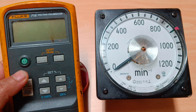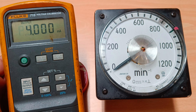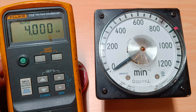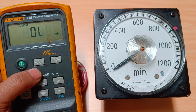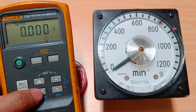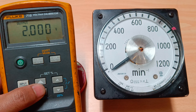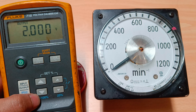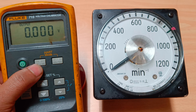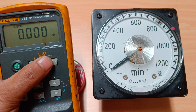Once we switch on the device, you can see it's showing 4 milliampere and it is open. If we want to calibrate using a voltage signal, we can select volts and by using the set button we can increase like one volt, two volt using the push buttons. That's how we can calibrate using voltage.